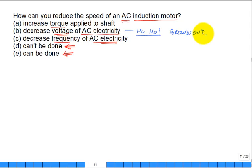So also, this is a brownout. Anybody heard of blackouts? Utility has a blackout. What happens? They cut the power. You're without power. True? But what's the alternative to a blackout? A brownout. What's a brownout? They don't give you 120 volts. The supplier of electricity is having a hard time delivering it. It's trying to push it out, and there's more people needing it, wanting it. Maybe they lost a power plant or some other source, and they'll let the voltage drop.